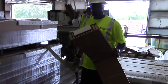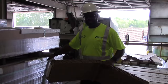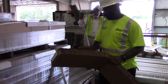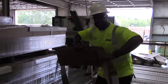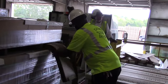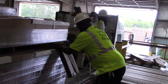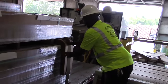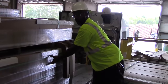What I use is these cardboard edge protectors. When you start tightening your straps down, you tighten them down on these cardboard edge protectors so it doesn't start crushing your boards. All you have to do is just bend it in like this and stick it inside — this will help from crushing into your boards.